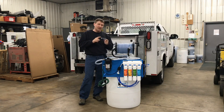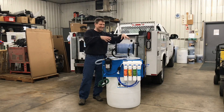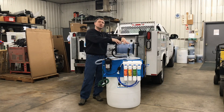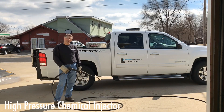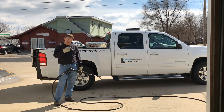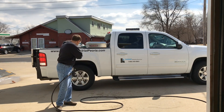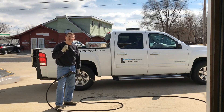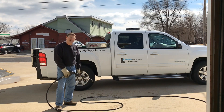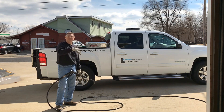So if you want the end result to be perfect, you have to use spot-free rinse. We'll show you that today. We talked about the chemical injectors and how different ones work, the chemicals and dilution ratios, which ones work with a chemical injector and which ones don't, and the final step will be spot-free rinse. First I'm going to show you high-pressure chemical, then the downstream, then the foam. One important point: if you're doing vehicles with beams and such, make sure they've cooled off with fresh water first. We're always going to apply chemical from the bottom up and rinse from the top down.